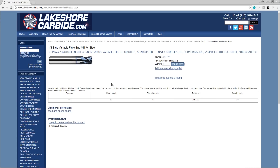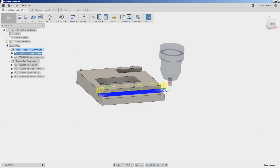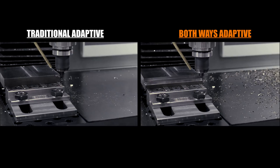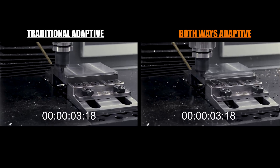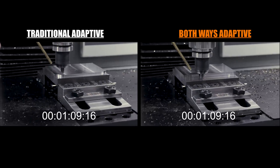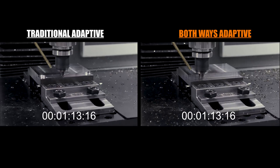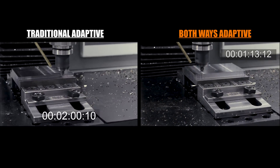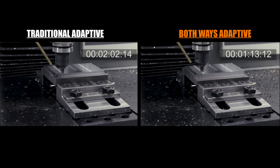So we wanted to try steel as well. It is a quarter-inch stub length end mill, four flute, from Lakeshore Carbide with a very small corner radius — link to that tool in the video description. Similar shape, similar example — let's take a look at some 4140. The reason you should test this is that both ways adaptive has the potential, especially on those open contours, to save time, but you really don't want to save time at the expense of process reliability. We want to make sure it's a safe, reliable cut — we're not going to load up that tool and break it, damage our workpiece, or generate so much heat that we ruin tolerance.